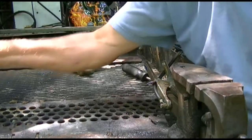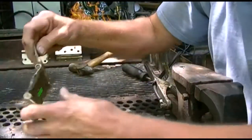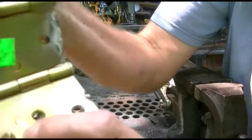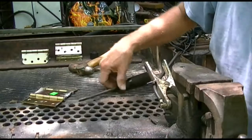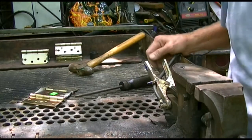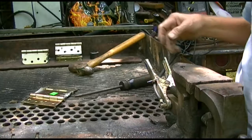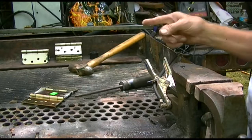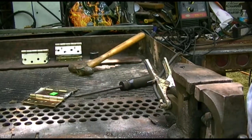My suggestion is make a little tack and try it, and if it doesn't work you can knock it apart. When I was welding these welds, a couple times a little piece jumped. It is amazing how strong that tiny little tack is. See that tiny little tack? I drove this big screwdriver down through the other side until it popped apart and it took a fair amount of effort. It's enough to give you fits if you're not careful when assembling something. Now I'm going to get my measurements and get started laying out the actual pantograph.